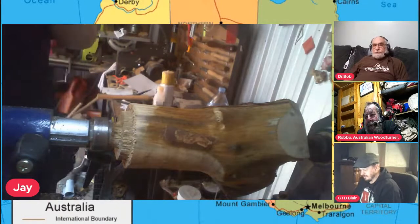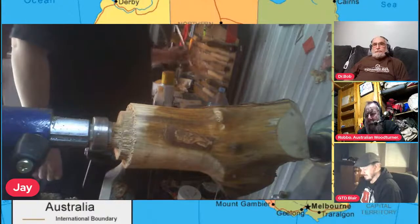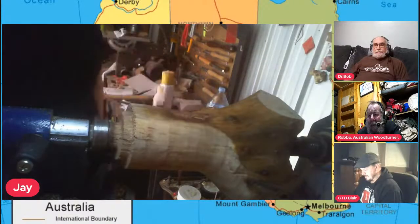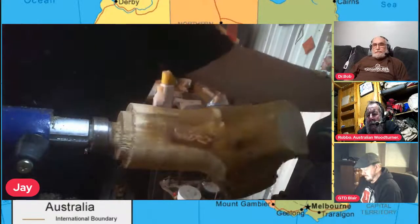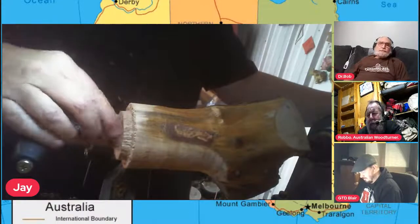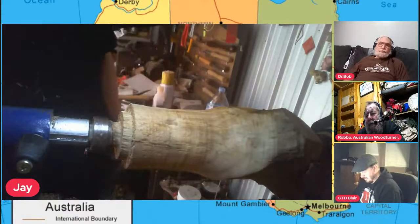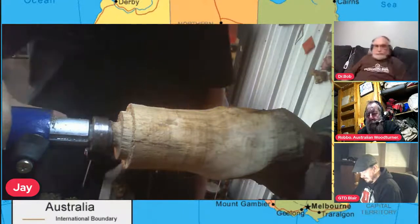That is terrible. Oh, you're telling me it does. Is that slightly rotten there on this side? It's a bit punky, yeah. Just get your fingernail, Joe, and see how soft it actually is. It's hard. Oh, that's all right. Then we'll form your tenon there. That should be all right. That's it. Doesn't need to be bigger. As long as it's a 2-inch, that's fine.